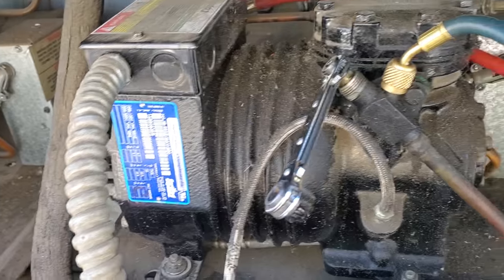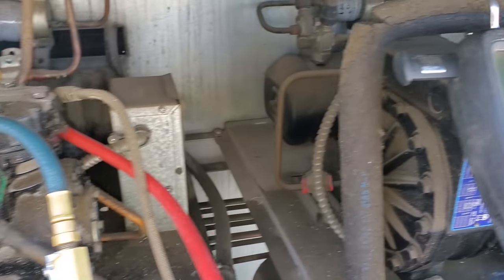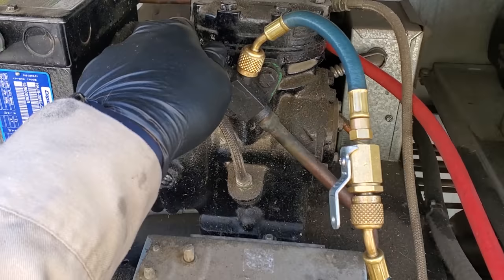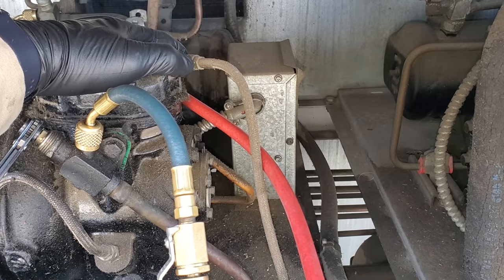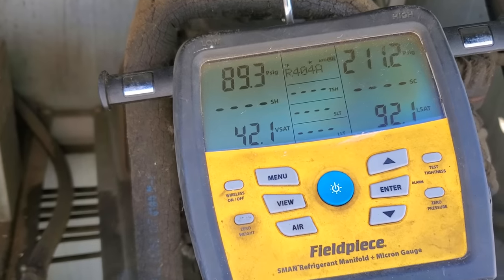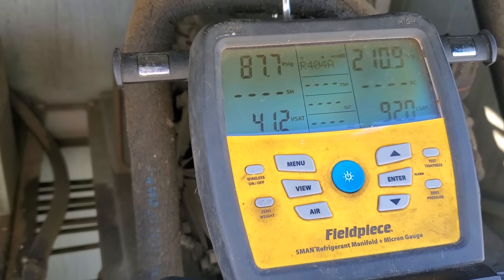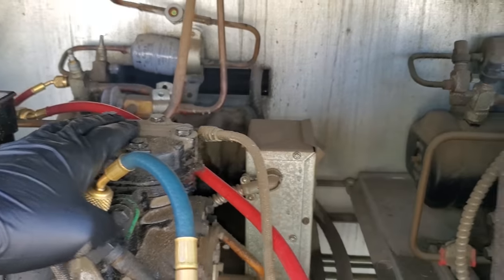This one actually isn't a K-body, but I should say semi-hermetic. We're going to power down and see if it holds the pressure. We're powered down — we're not leaking back really fast, but it's sure not pulling down very fast. Sometimes you can feel it. Yeah, that's interesting — that's not good. It should have pulled down a lot faster than that. Suction pressure seems to be coming down. We probably have a few valves that are flooding because I did get each box up to about 60 degrees. It is dropping, but it concerned me with how high it started.